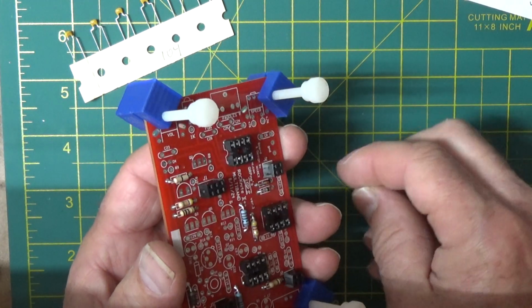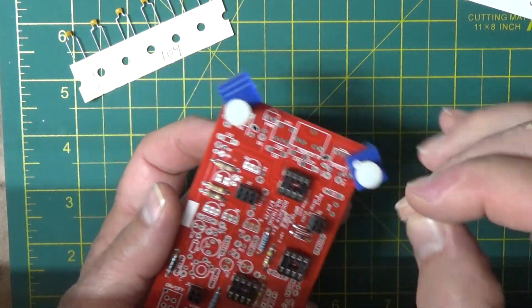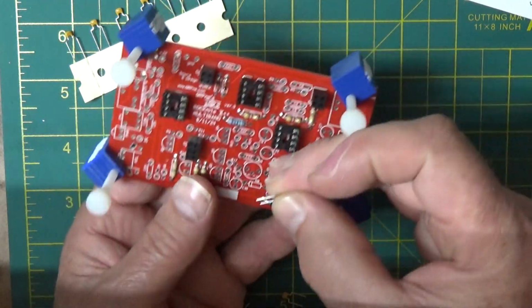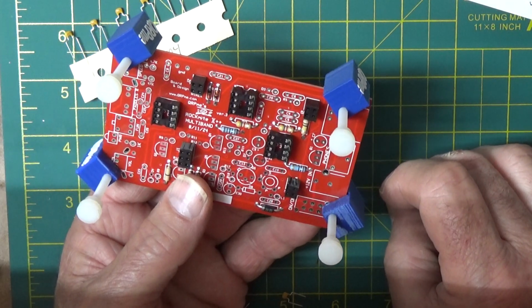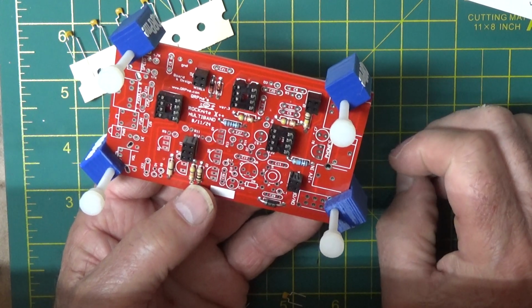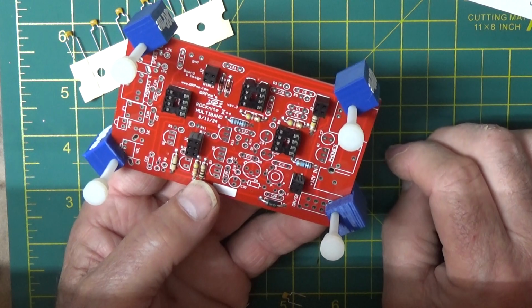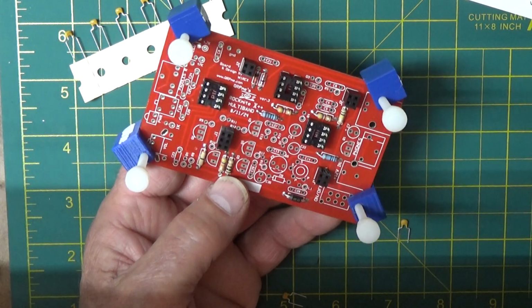0.01s, and I can look on the list. It says C3, 13, 20, 21, 27. So, C3, 13, 21, 27. Turn it upside down so I can read it properly. C3. See, this is what I mean. Well, now I'm trying to find a C3 on this board. That's not good. C3. I could probably spot them a little bit faster on the schematic.